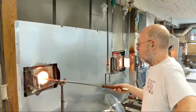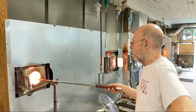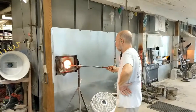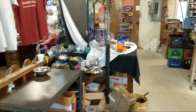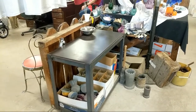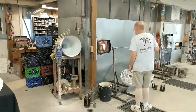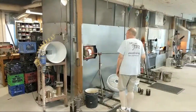This allows the glass blower to reheat the glass while he's in the making process. Once the glass cools a few inches, it gets a little bit trickier. So one's got to reheat it — that's the purpose of the glory hole, the reheating chamber. Foster's going to melt that aqua color in, and then what he'll do is come on over here to the metal table, the marver. He'll shape the glass on that, and then we'll watch him trap some air in the blow pipe. After he does that, we'll see the bubble expand into the color.